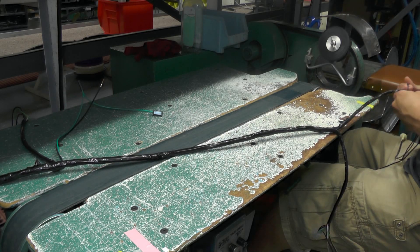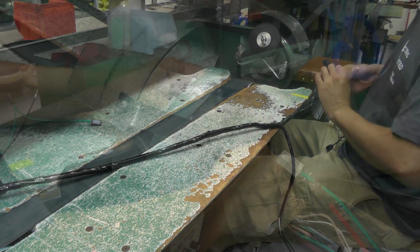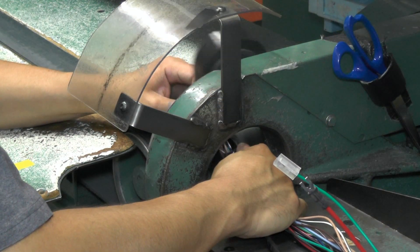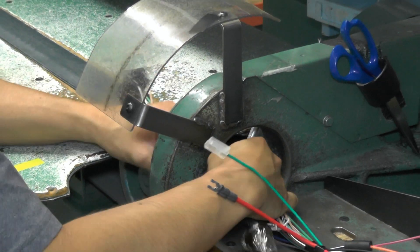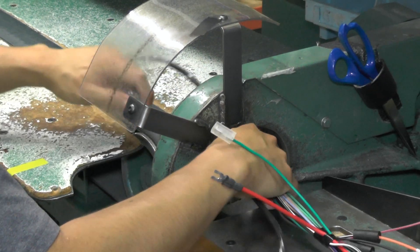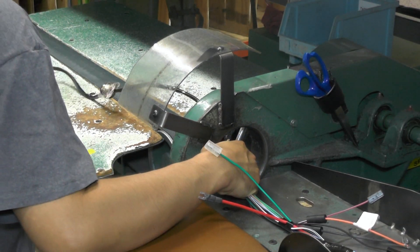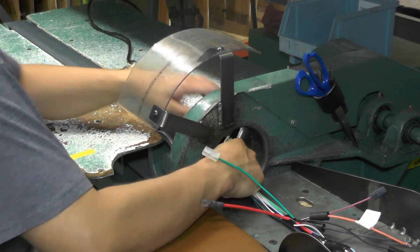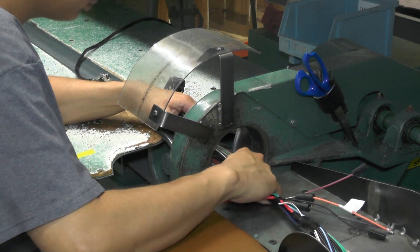This was done for speed and the elimination of having to use adhesive tape. This is the taping process from a different angle. As you can see, the wires that are not destined to be taped, as well as previously taped breakouts, are pulled through. Previously taped sections were hand taped on the assembly board, as they are too short to be effectively taped by machine.